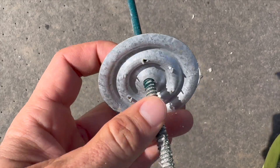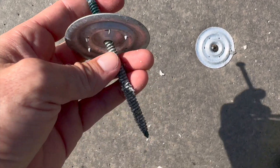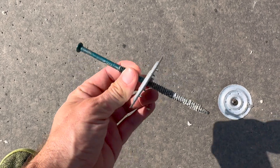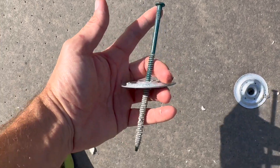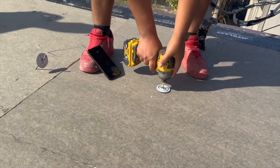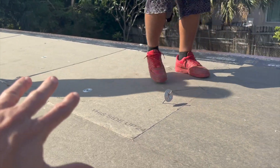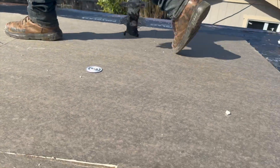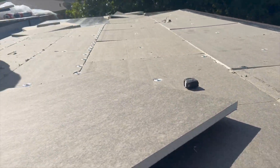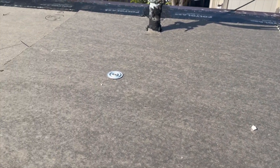Here's a good look at the plates — you can see the little spikes that grab into the insulation to help hold it down. And here's the screw; this is like a six-inch screw. Right now we're just getting the pattern out and tacking these down. We're not installing per the engineer specs of how many screws we need to be putting in for each board — just tacking them down.